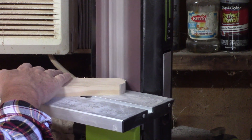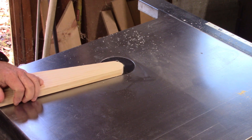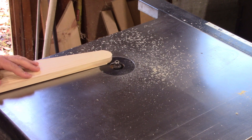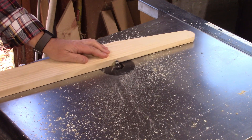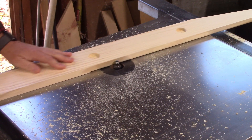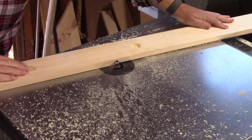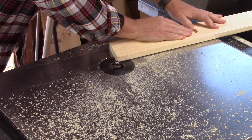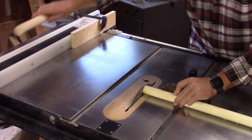I'll use my sander for this, because I'll be sanding the entire piece again anyway. Then I go to my router — I've got a quarter-inch roundover bit. I try to do the end grain first, and I will do all sides except for the very bottom, basically where the foot is — I'll leave that square. But I'll do all four sides and just round the whole thing over. Don't want my little granddaughter to get hurt if she falls on it.